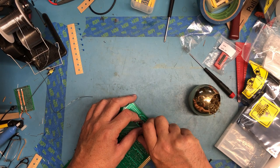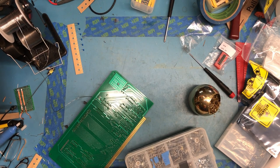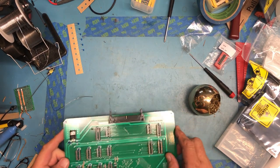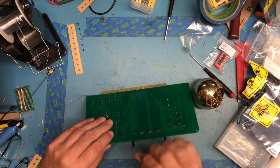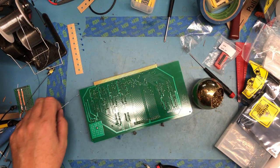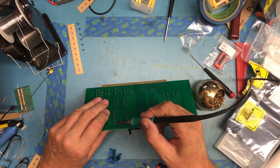Trim these leads off. Oh, got some screws that I left loose. Getting really close to being done. I'm going to go ahead and solder in the programming header. Maybe. Just in case I ever need to reprogram the PIC that implements the state machine. This is optional because I put the diode in, which is part of the programming circuit. I might as well complete everything.